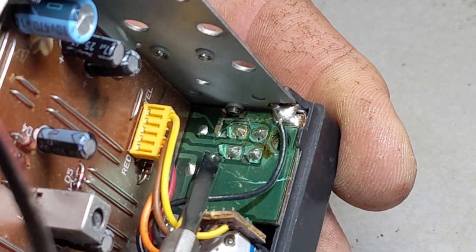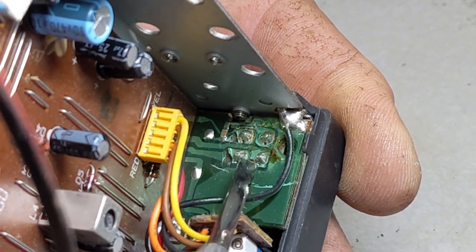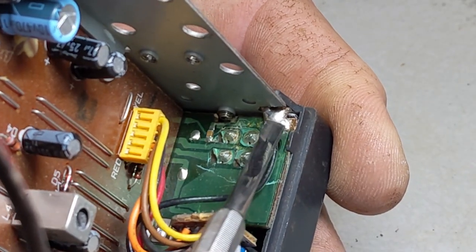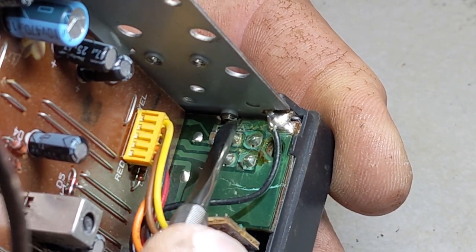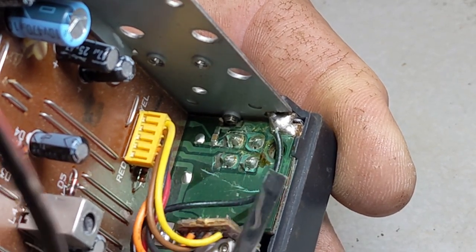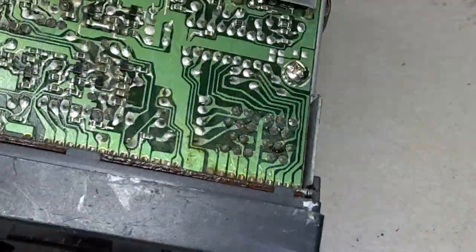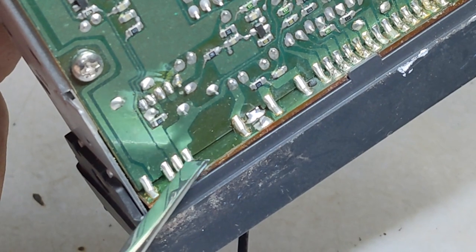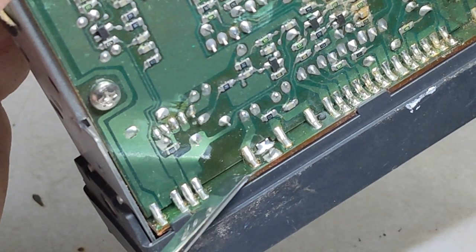As you can see here, when the microphone goes onto the board, the traces are broken. That trace there was broken, and that one's ripped off the board as well. The only one that looks like it's still intact is this one here, going down to a really thin wire off that board. So definitely that one's broke, that one's broke — and that's from pushing it in or stretching. Now, on the back side of the board, these are your microphone connectors. This board is only soldered onto the board, so those could break very easily as well.